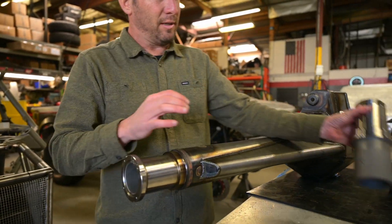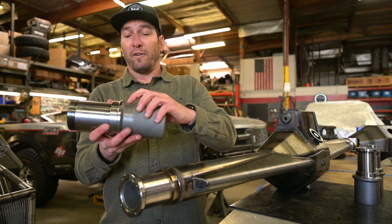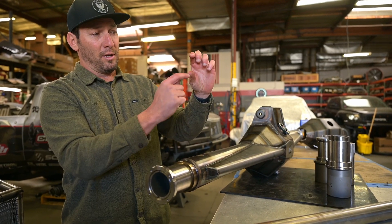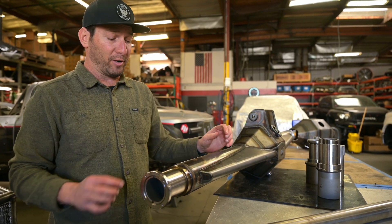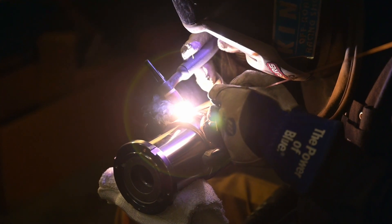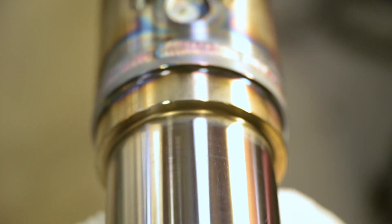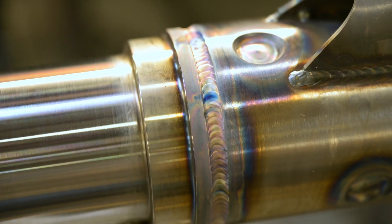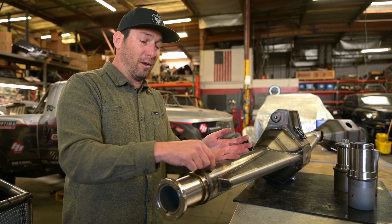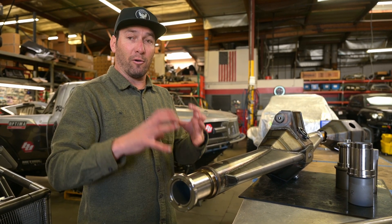On this rear end, these snouts have a V-groove right here, and when that matches up to the flat tube of the rear end, we have a very large fill of weld to make. We want to ensure the whole side of the tube — basically this whole side of the piece of tubing — is welded from the bottom all the way up with 100% penetration. This weld is somewhere between seven and ten passes, so it's very critical that it gets done properly. It takes a lot of time because it has to weld, then cool, then weld again, going back and forth to other products through the shop. We also do the rosette holes — you'll watch the drill process on that — with a heavy chamfer, so we burn the bottom of the chamfer with a rod into the snout. There are four spots for that, and it keeps the rear end to the snout intact as much as possible.